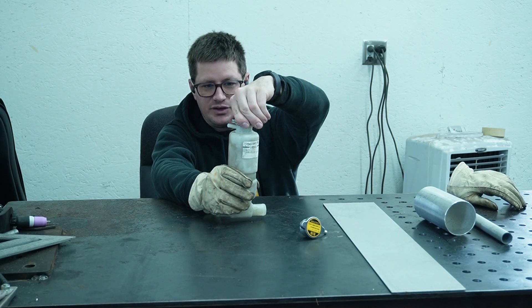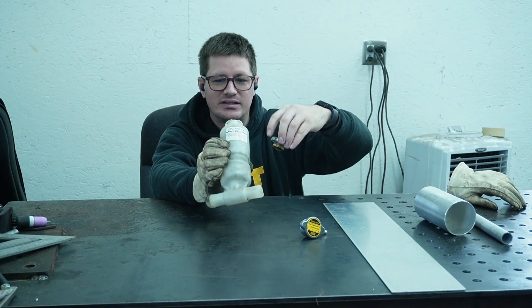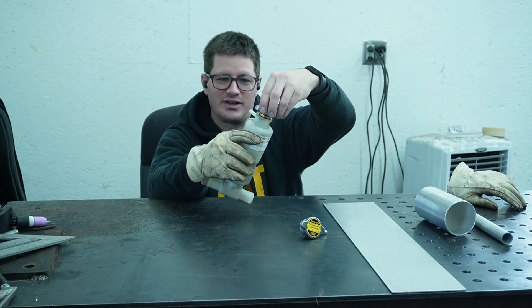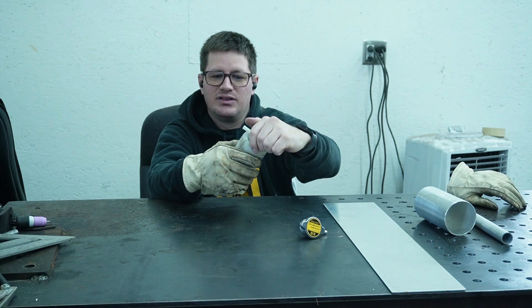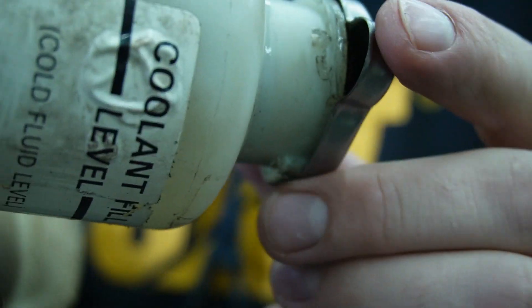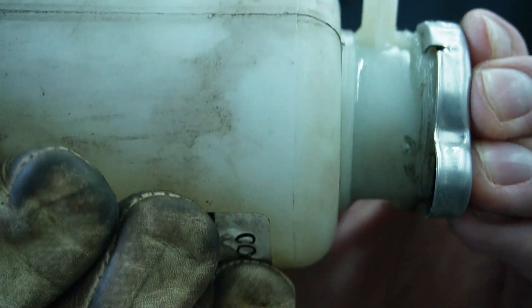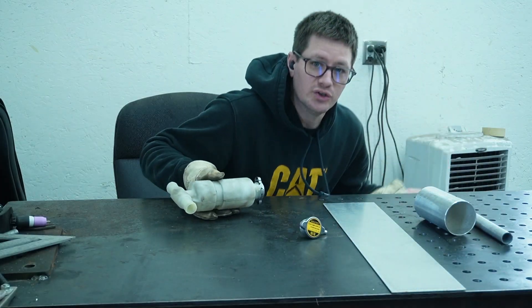What's happened with my snow machine is, due to constant pressure and cycling heat, this opening for the cap is no longer round. So what happens is I can put the cap on and off, but when it's fully threaded on — because it's egg-shaped — this side pops off. That right there is not latching properly. This side is on all the way, but this side's pulled off because it's out of round. I can push that on and off, but it's no good.